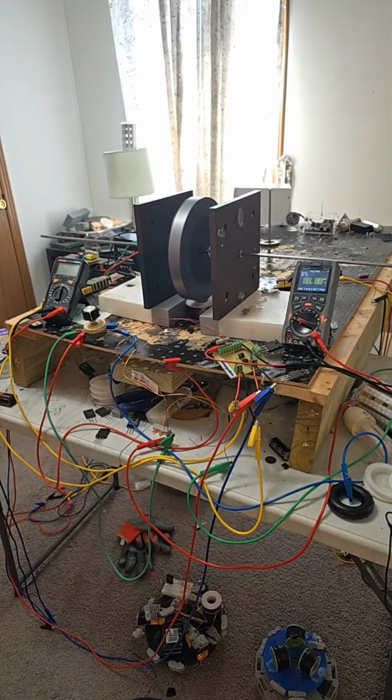So putting more hertz through it when it's open generates more voltage. But there is a resonance there. There's a, what do you call it? Where the voltage is the highest, and sometimes it's not just continuously going up on the knob. There's a range there. Resonant frequency. There's still a resonant frequency for what you're putting in.